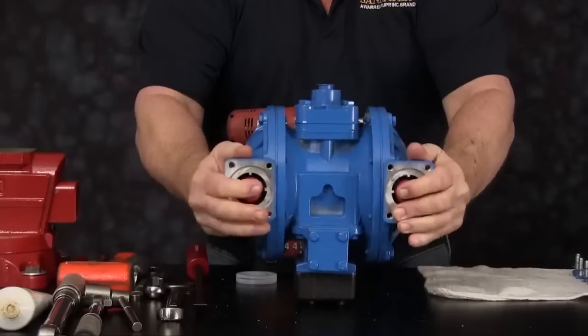Roll the unit up on its side again, removing eight cap screws to remove the opposite outer chamber. Once the chamber is removed, we can now push the diaphragm rod through the intermediate assembly and remove the second diaphragm assembly. Next, we need to disassemble the diaphragm assembly. Today we will use a vise with soft jaws. Soft jaws are utilized to ensure that the shaft is not scarred, scratched or damaged while the shaft is clamped in the vise.